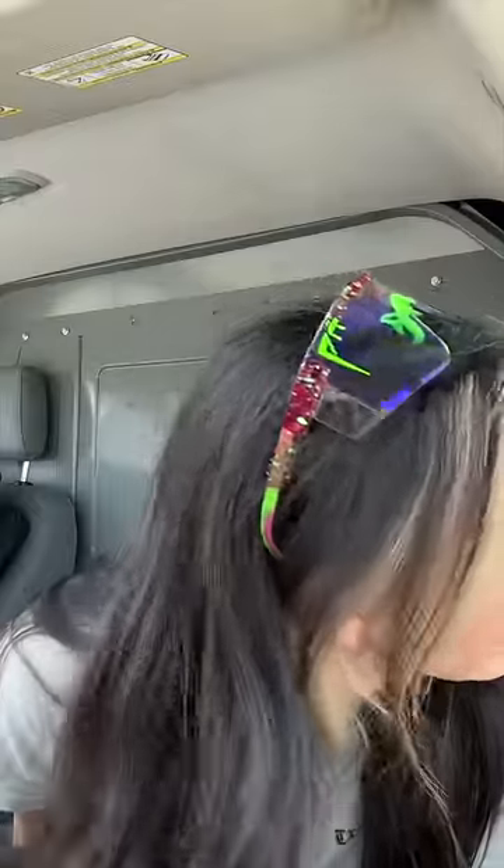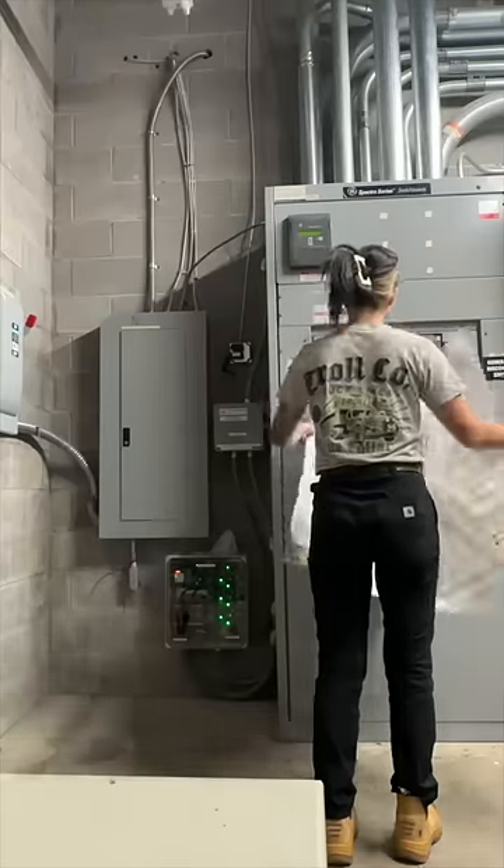Today sucks and I'm troubleshooting light poles again in the same place. These 480V light poles keep blowing up and we didn't install them — they were installed a long time ago. We have seven lights out over there, one breaker is tripping aggressively, sparking inside the panel. The panel's jacked up. Let's go show you what we got.